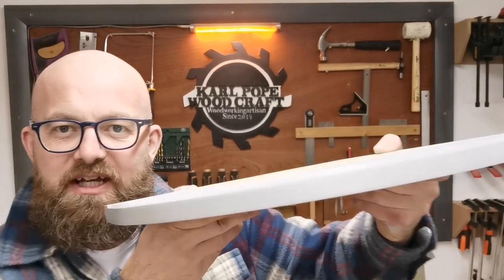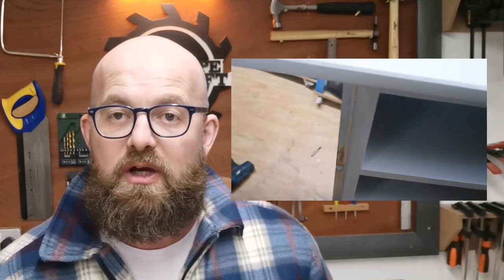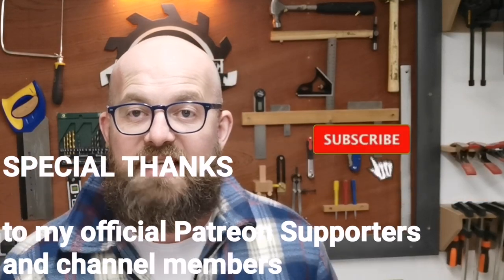There you go guys — a lovely finish. Believe me, that's a really good finish. To recap: all we used is good quality MR MDF, a good quality acrylic based primer, and a good quality top coat — silk or eggshell, both available in acrylic. They dry quicker, they're easier to clean, they're hard wearing. We used a good quality foam roller, first sanding with 120 grit, then 240 de-nibbing between coats — one primer coat and three top coats. On that last coat put it on nice and evenly, lay it off, and you'll get a nice consistent finish.